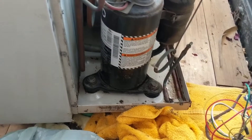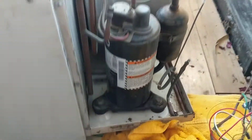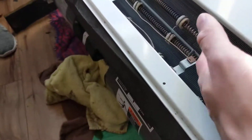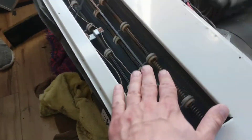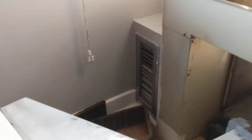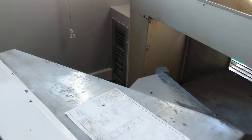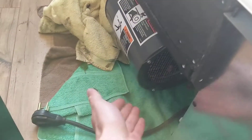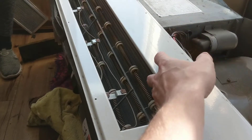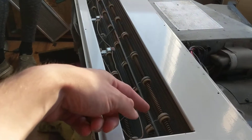What we found is there's a condensate catch pan here. The way it gets water: this is your cooling coil. Room air comes in from the bottom through these fans, gets sucked in, passes through this cooling coil, and gets shot up. If it's stuck in here it comes out of that louver, otherwise it just takes air from here and pushes it up to the top.